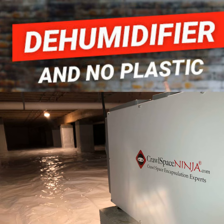If you're in one of these code districts that's really picky when you go to sell your house, that could be important. Now, if you live out in certain parts of Tennessee where they don't care about code, it's not really a big deal. The other thing is, a proper vapor barrier is going to allow that dehumidifier to cycle on and off properly, and it's not going to run it to death — it's going to live longer with that plastic installed.